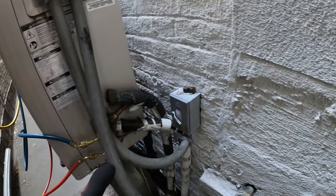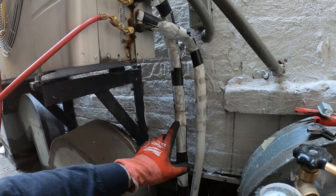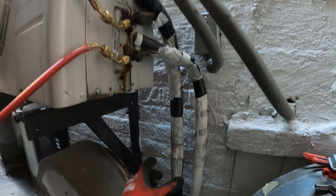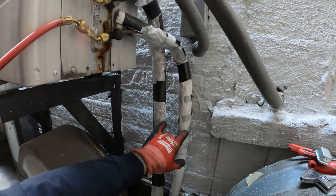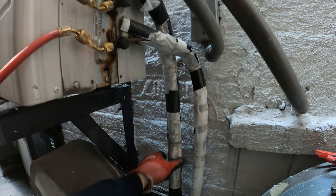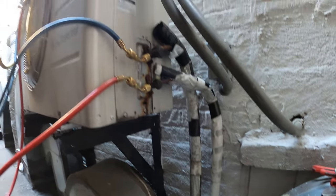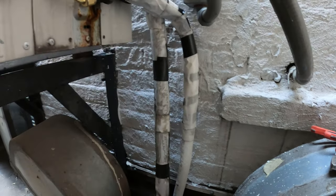The reason we're going to do what I'm doing is because I don't know exactly where these pipes go. Sometimes these pipes are behind the wall and there's no search you can do. So what we're going to do is actually cut these pipes right here, crimp them, and put in a pigtail so we can check pressure. We're going to isolate the outdoor unit on its own, isolate the indoor unit on its own, and isolate each line — so the system will be in four different places. We'll pressurize each section and then see where we lose pressure: is it the condensing unit, this line, that line, or the indoor unit? Let's go ahead and cut this up.